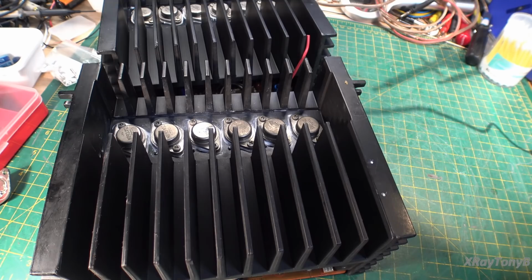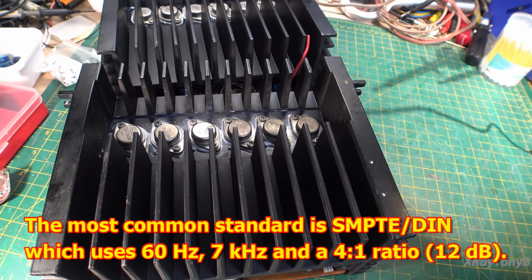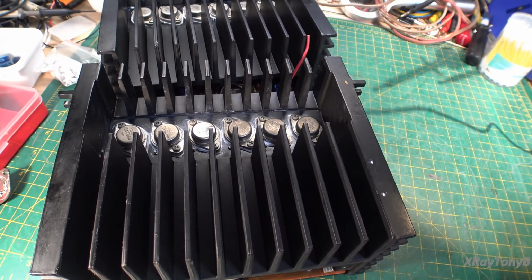Well, we're familiar with intermodulation distortion, which is when you have two tones. The way you test for IM distortion is you take two tones. One of them is like, I believe, a 60 hertz sine wave mixed with I think it's a 1 kilohertz or 3 kilohertz. I can't remember. It's a higher frequency, like 3 kilohertz or 6 kilohertz. I'll put a little message on the screen here when I'm editing this. But it's a low frequency and a high frequency.